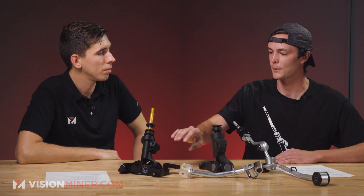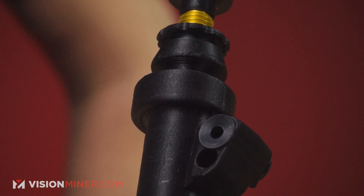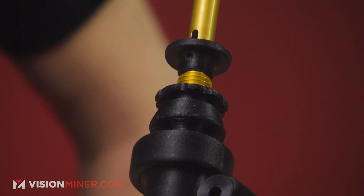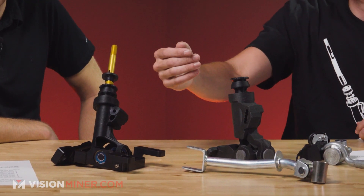The production version will be an A356-T6 aluminum casting, but while waiting on the sand-casting process — which takes a long time — the 3D-printed version is literally in my car right now and has never had a strength issue. I've driven thousands of miles on I-5 with straight 3D-printed car parts and it works. The 3D printing let me learn at my own pace affordably at home, prove my design, work out the mounting points and geometry, and then go to the machine shop to have it made in metal.